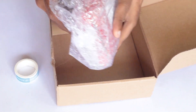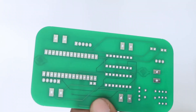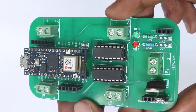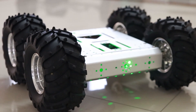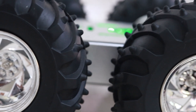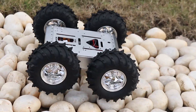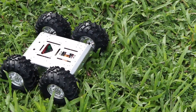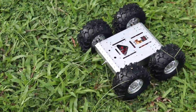Once you get all the components and the PCB, it's time for you to solder them together. Solder all the components onto the board and make sure to check the polarity of the components before soldering. Now setting up the robot chassis — this is a cool robot chassis I found online. This one has four huge wheels connected to four DC motors. The mud tires are strong and provide enough friction between the tire and the ground, which enables this robot to climb through rough and slippery dirt roads or rocks without much effort. You will find the link in the description.